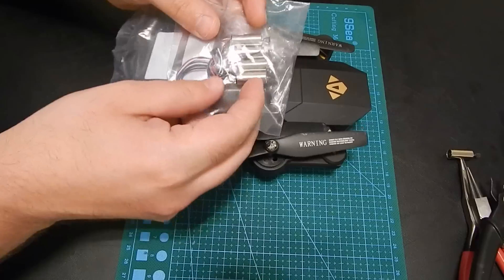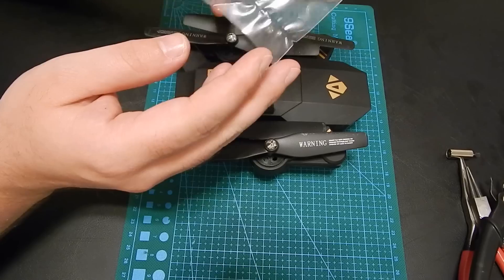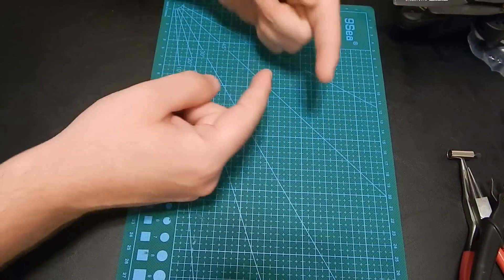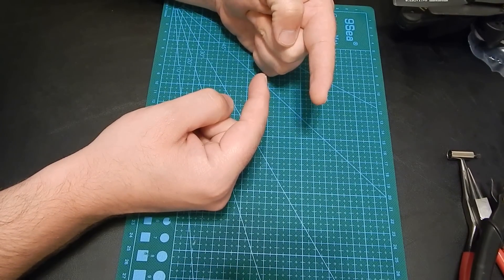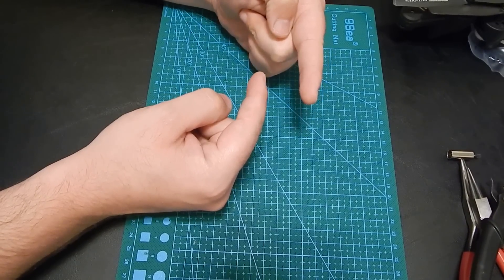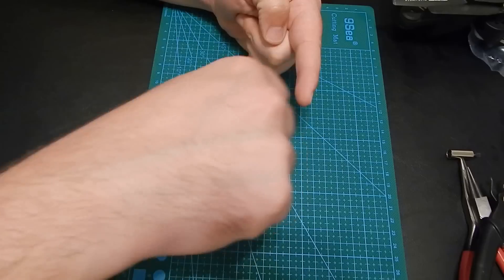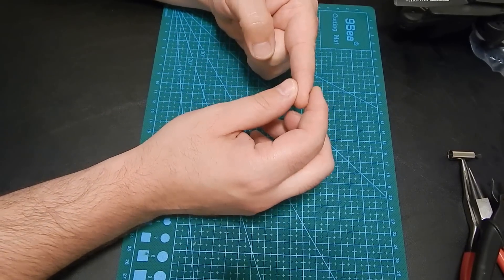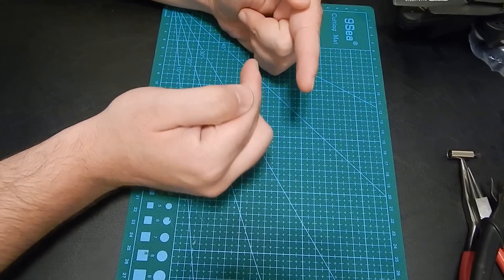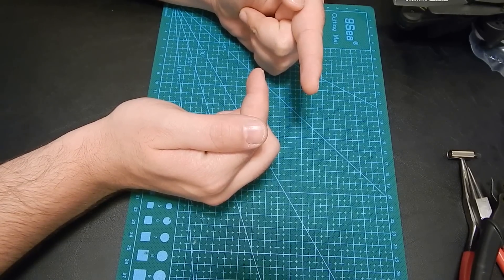I got here two clockwise and two counterclockwise motors. The difference between the counterclockwise and clockwise motors is that, since these are brushed motors, you get two brushes. If the motor is clockwise, the brushes are aligned like this — since the collector turns, it puts tension on it, not pressure, and kind of pulls the brushes on it and keeps them tight.